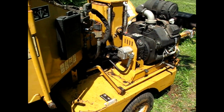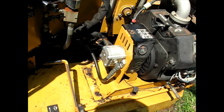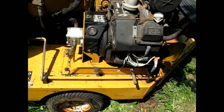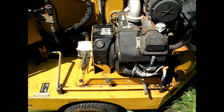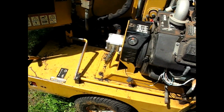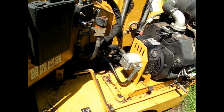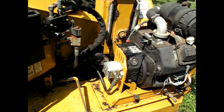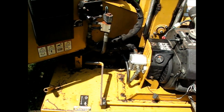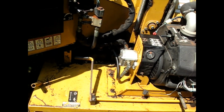Okay, so a definitive win on that pump replacement. Going with the OEM treated me good this time. Everything fit. The shaft size was right. The fitting sizes were right. It bolted right up. I couldn't ask for more out of that. Most of these manufacturers stop making stuff after a certain period of time. So we out in the field do appreciate this, folks, when you have the parts available, even if you do cost us crazy stupid money. At least you have it and it fits and it works, so I can't fault them for that. Love it when parts actually fit. So definitely, suction side air leak, probably at the pump shaft seal, definitive fix. If yours is doing the same, maybe have a look at it.